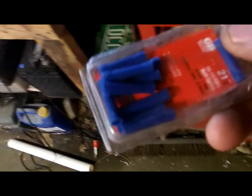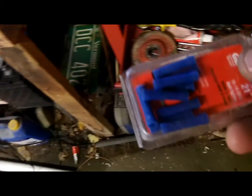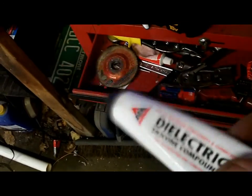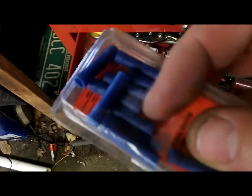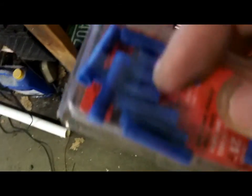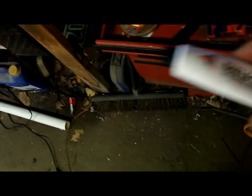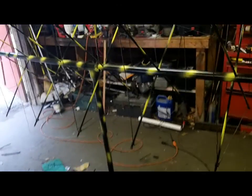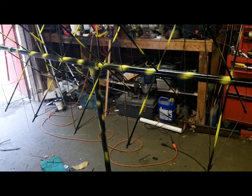Before I put the shields into the crimp connector, I use a little bit of this — or you can use a wire nut. There's nothing wrong with a wire nut. If your house doesn't burn down, it's good enough for an antenna — that's my philosophy. Apply just a little bit inside each end of the crimp connector, then jam the shield in and slam it down. That'll prevent the shield from oxidizing. I've taken PL-259s apart after two to three years and seen oxidation inside, so I always do that as a precautionary measure.